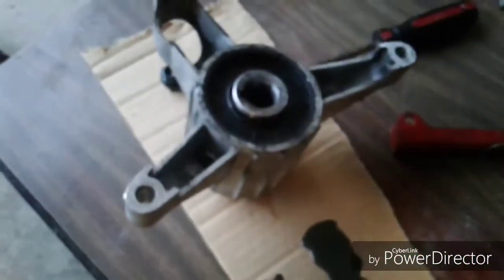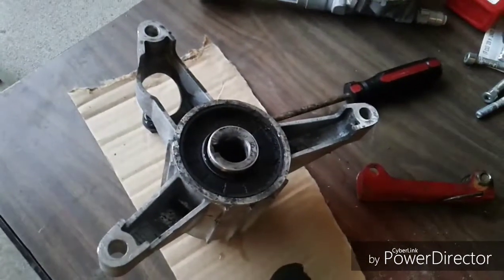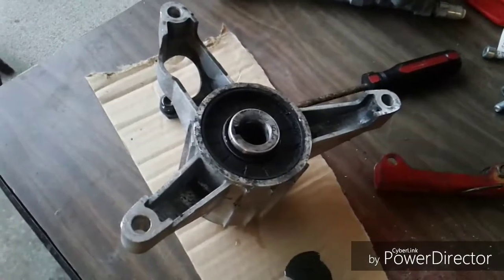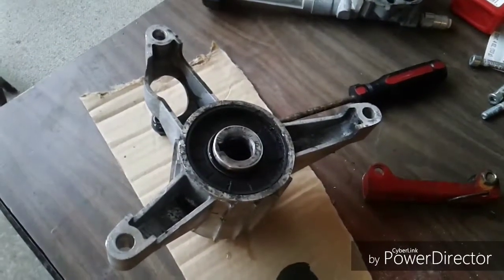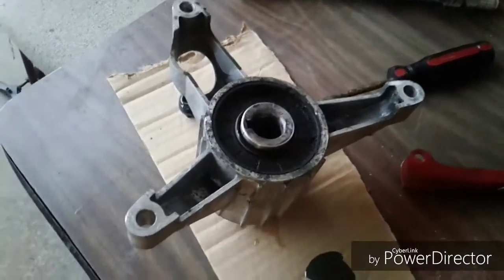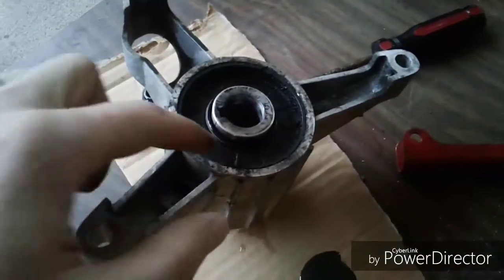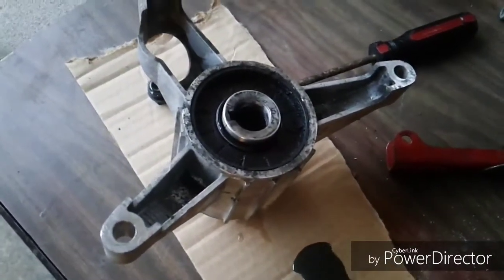It's a long keyway. And don't substitute those keyways. You see them in flywheels of push mowers and things like this. It is a softer metal. Don't put some regular old steel in there, it's made to give in case something bad happens. So I'm going to try to pry this plastic off and see what's in there, and I'll change the grease as well.